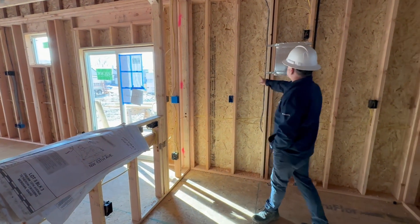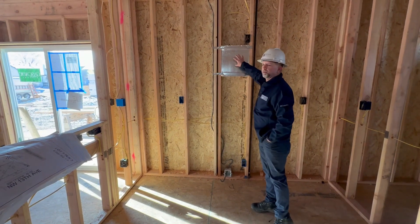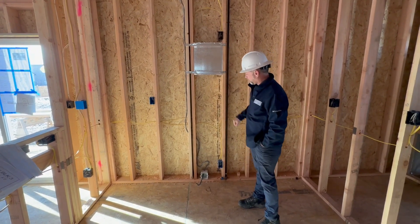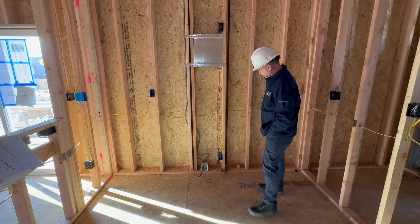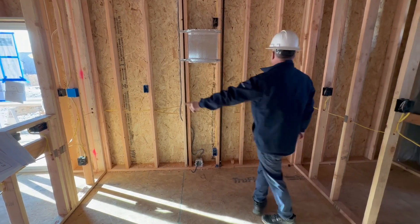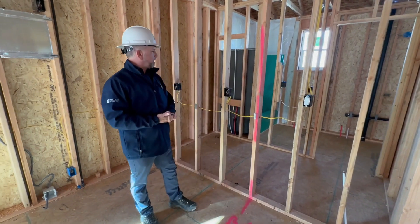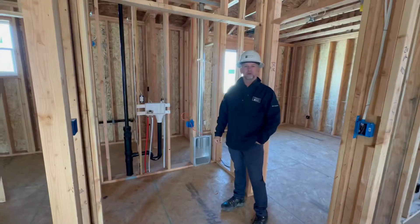You have outlets and switches along the wall at your arch opening. Two-by-four walls interior, two-by-six walls on the exterior. This is your range wall — your microwave has a plenum inside the wall so you'll have a usable cabinet up top where the microwave plugs in. It vents outside, not inside. You have 220 for the range but you've opted for gas, so you'll have a gas range. GFI outlets split the kitchen — one on each side.